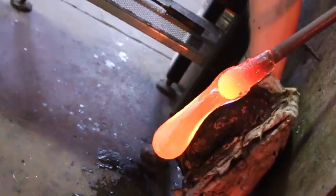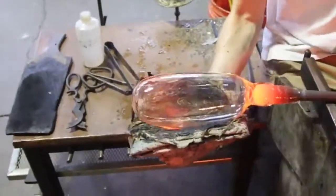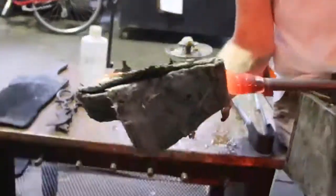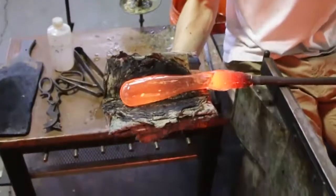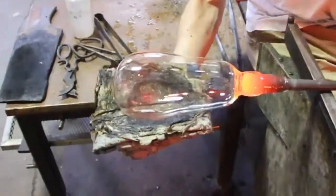Now I'm going to play the video again and we're going to see what happens. Still managed to get it up horizontal. You can see that neck wobbling around and how thin it is — there's no way that thing would be able to support all the weight of the glass on its own. So rewinding and taking one more look: it's dropping out really aggressively, and I have the paper there to actually physically lift that glass up. That's the big difference — you're using the paper to lift the glass, to take the weight off of that thinner, too-hot material, in order to bring it up and blow it. I've got an assistant blowing for me. If you don't have an assistant and you're that hot, you're pretty much sunk — you're right there on the knife's edge. But with good communication about when and how hard to blow, and that paper at the ready, you can save the day.